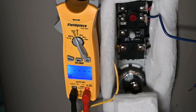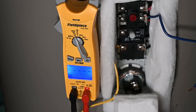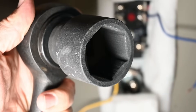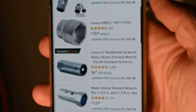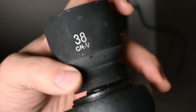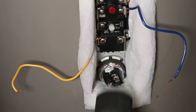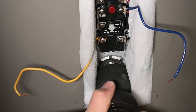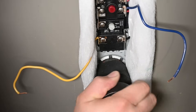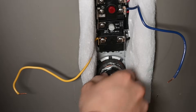We should be getting close to where the water has drained down past this element. The size of socket you'll typically need is an inch and a half, but sometimes it can be up to an inch and 7/8ths — I'll link to both in the description. If you only have metric wrenches, 38 millimeters is very close to one and a half inches. We'll get our wrench over the top of the old element and give it a good push — and it's loose already; that one wasn't bad at all to break free.